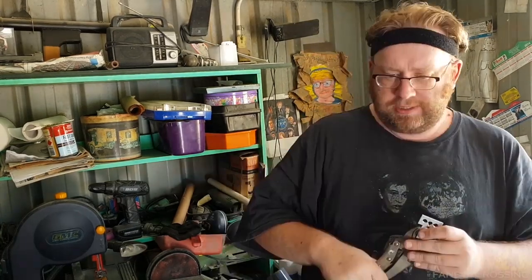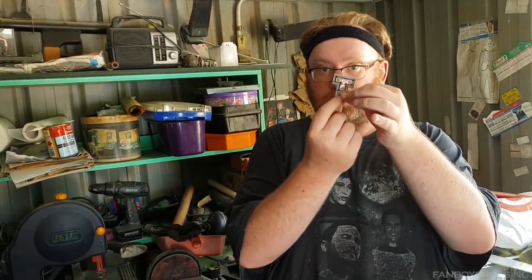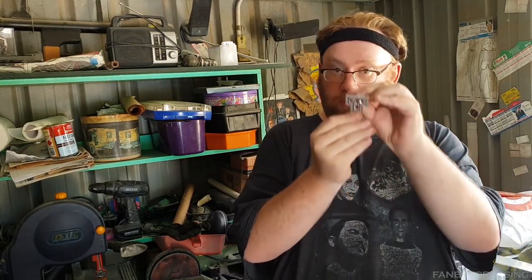I've already done a little bit of prepping this morning, already drilled out. It's on a clamp because it's aluminium, so it's metal, metal loves heat. Drilling creates friction, creates heat, and so I have to use a clamp. That's pretty much done for now. So I've got the hole there. That's where the button's going to come through. And all those other holes.